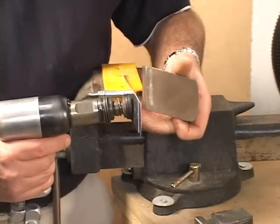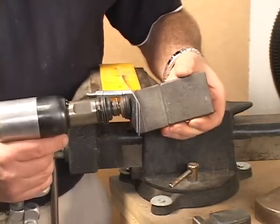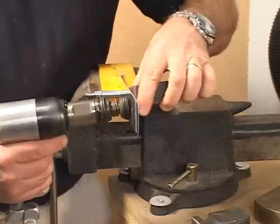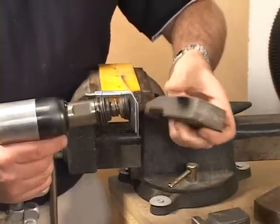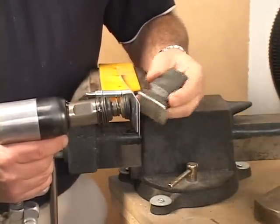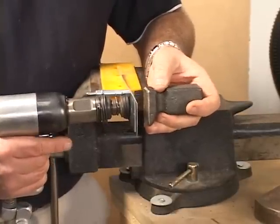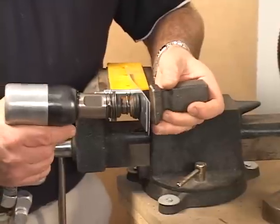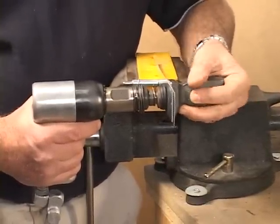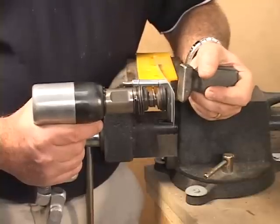Here's just another style for a different angle. This is a very unusual style — you can use it to get in this way, or this way, or this way. So many ways to get in there to reach a rivet. For these small rivets, I like to use a small palm type bucking bar. The important thing to remember on riveting is that a lot of people think you have to push with the bucking bar so hard that you're actually doing the work. It's not — let the bucking bar do the work for you.